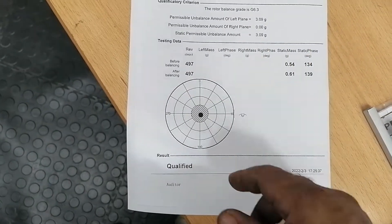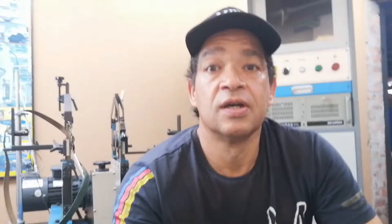So there we go guys — that is an impeller completely balanced. What I didn't show you was the calibration putty that you add to the impeller midway through the process. You add some calibration putty and then enter those figures into the computer. I didn't show that part, but there is a putty I use midway through the process.